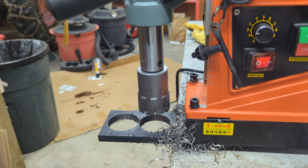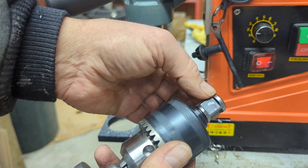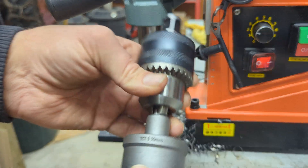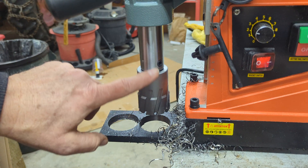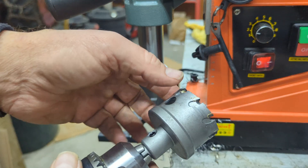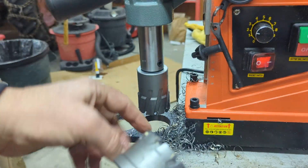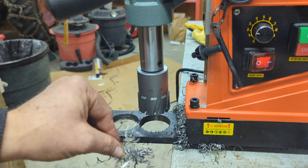Overall, I'm super impressed with this tool. If you don't buy the bits that come with it, it's $209 currently. This is the adapter that comes with the VVOR tool that goes from the Weldon shank to the threaded chuck. This cheap bit is about $15, and this one is more like $70 and makes a much nicer hole. But if you're just welding a piece of pipe in there, the cheap bit might be just fine. I'm also impressed that these bits made long curly chips — that means you've got a nice cut going on, in my book anyway. I'm no machinist.